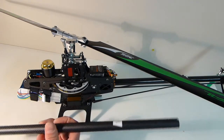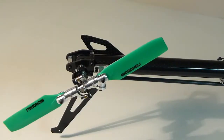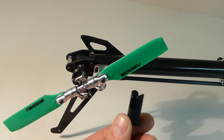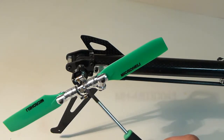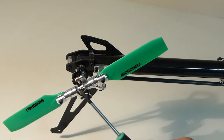After a lot of that work, I moved to the tail. The original tail grips were made of cheap, flimsy plastic that I didn't care for. What I came up with is a tail rotor off a Blade 450x — a micro heli tail rotor that works with this 4mm tail shaft. It's aluminum alloy, so it's a lot more rigid and positive.